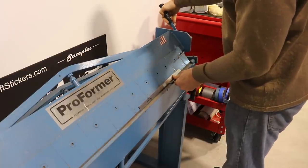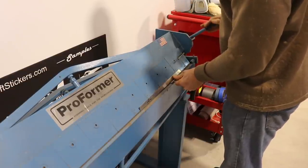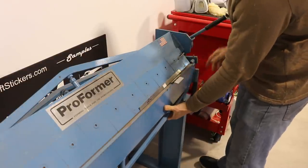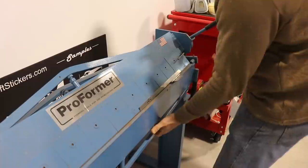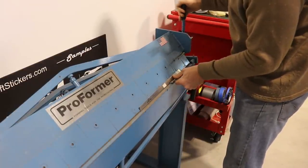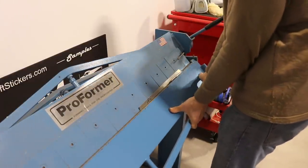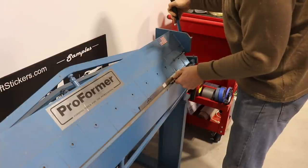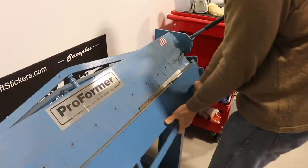I'm using my 48-inch brake to bend these hinges into that curve. What I do is just start at the top of the hinge, bend it a little bit, pull it out, bend it some more, pull it out, bend it some more, and eventually you get a rather nice curve. Now, if you don't have a bending brake, you can also put these in a vise and kind of tap them over with a hammer. That's how I had to do it on my cruiser, but this bending brake worked really nicely.